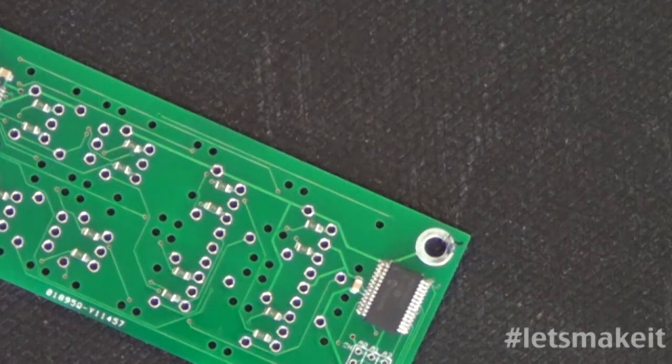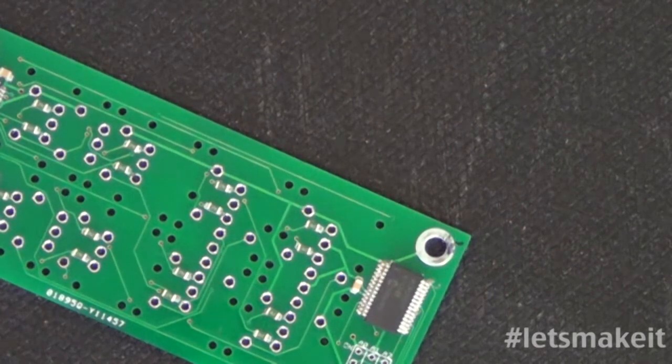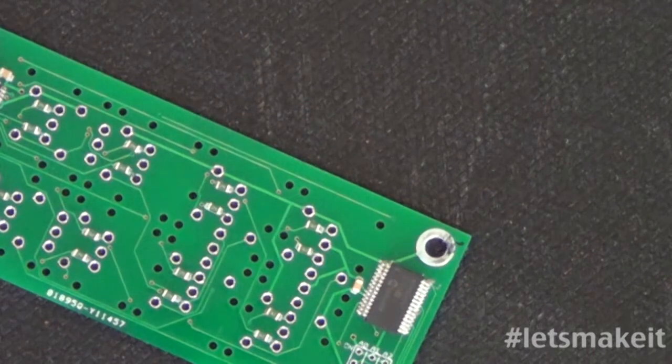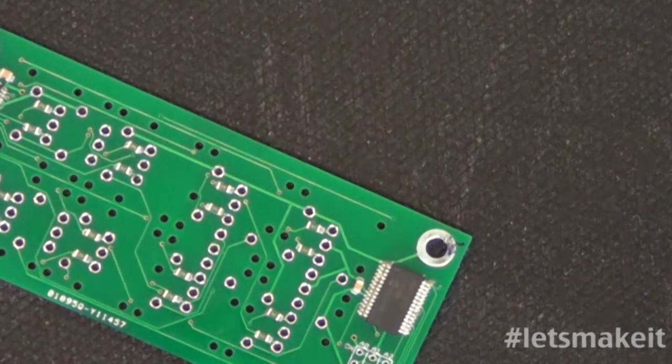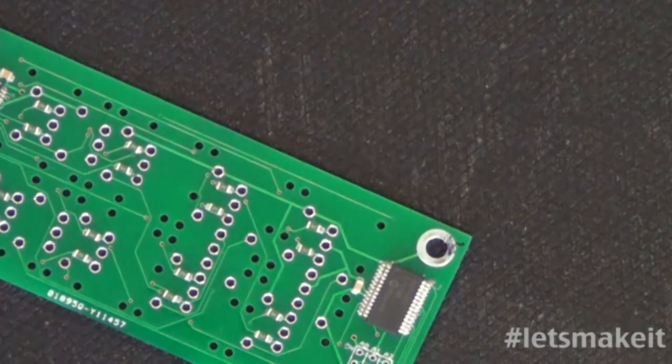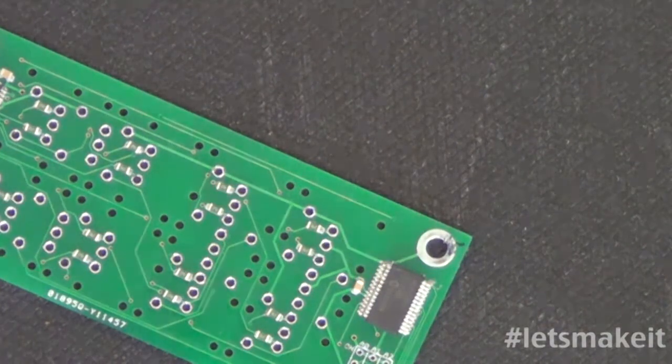It does seem like it works a little bit nicer than just turning it the whole way up to 400, which is this griddle's top temperature. It should be like 450 probably for our real good solder, but it does get hotter than 400. And that's why sometimes the heat gun just helps to augment that. So I will fast forward through this section.